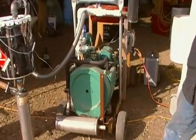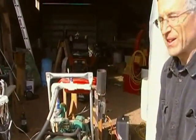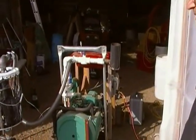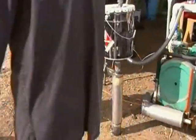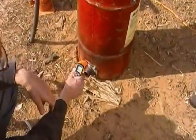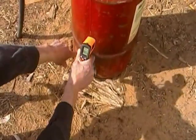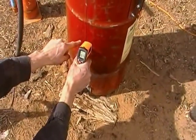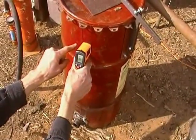It's been running an hour and 15 minutes with a load. Our temperatures are: the gas inlet is about 400 here, drops off to about 200 by this point, and all the way down to 84 here.